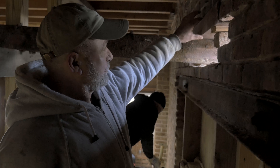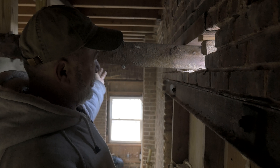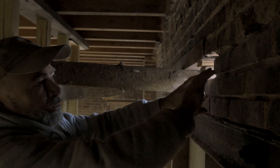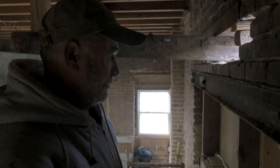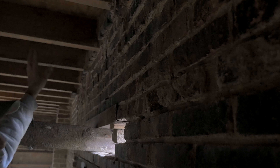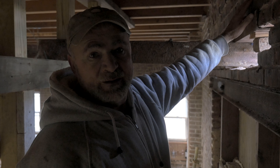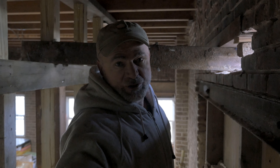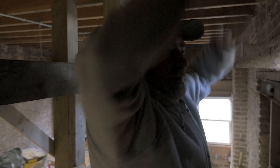You see the lintels here? On both sides — one inside, one outside. We put this heavy duty lintel across to hold this area so we can take these bricks out to free the beams, to put in new beams. That's what we're doing now. All this is loose — that's why we're doing this extra work. Everything was loose. After I power washed here, I put a chisel and everything was moving. Anthony witnessed that.